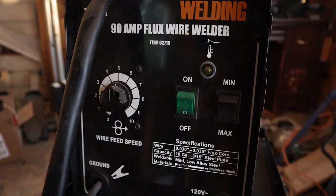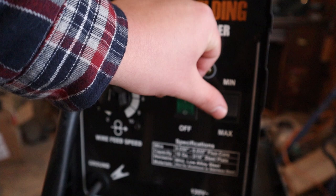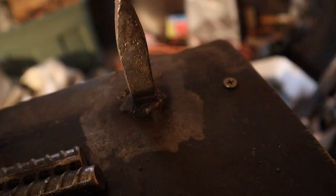Today I'm going to show you simple techniques to use with the Harbor Freight Welder to get the best results with your welds. The settings I use for most welding: I have this set to max and about 5 on the wire speed. If you're burning through your material, you'll have to set it to minimum — that'll reduce the amperage — but I leave it on maximum most of the time because of how cold this welder is just in general.